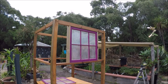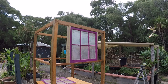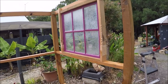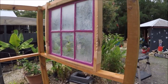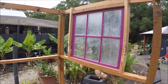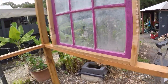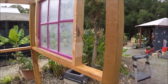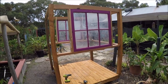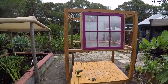That window is now anchored in position. I have to do the other one on the other side but I've run out of screws, so I have to go up to my favourite shop and get some more. I got more screws and we now have another window in. It's pretty rough - part of the problem is the lack of timber and supplies. I'm having to scrounge and scavenge, so I had to do a little half-lap join on each side to extend those pieces to give a bit more support on the window frame. Hey, it's a bush build, but I don't think it's looking too badly.